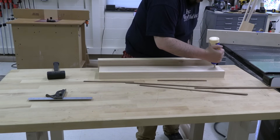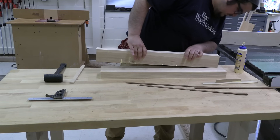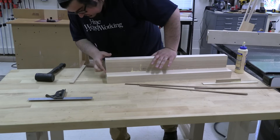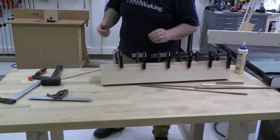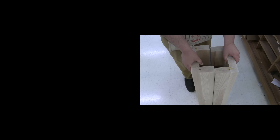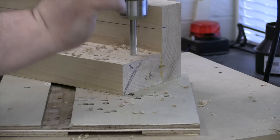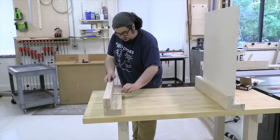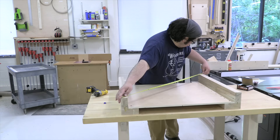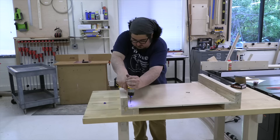In those grooves I milled in, I'm installing some eighth-inch hardboard to keep everything aligned when I glue up the L assemblies for each leg — and this worked beautifully. They came out as flush as you can want. Each leg is a big eight-quarter ash L assembly. I then drilled holes for bolts to attach all the assemblies together, and glued in a piece of plywood between each leg on the side to keep the whole thing from racking, making the base two solid assemblies with long stretchers in between.